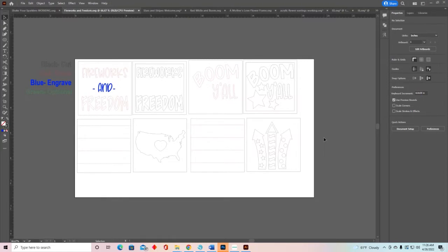Then you'll want to make sure that everything is actually on that wood piece. You'll have to put a piece of wood in your Glowforge so that you can see it — that is a picture of the wood I'm going to cut on. Next we're going to start going through these layers. The first one says 'engrave.' It's because it's reading it with that fill color — it already knows that it needs to be engraved. The next one is the cut. You'll notice that all of those black lines are showing up. They show up as red in the software, but it's all of the black lines, and it knows to go ahead and cut them.